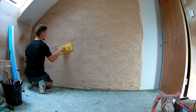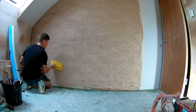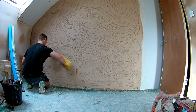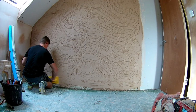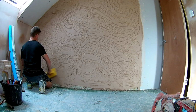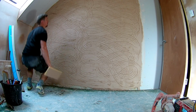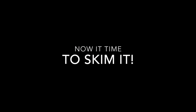As you can see, you'll see me working in an area, you'll see it in a minute. I keep coming back because there are a few high spots here. What I'm doing is I'm pulling them off and I'm getting rid of them. We don't want them there, we want them to be gone, so I'm working my float into them and then forcing them, pushing them out. So again, give it 30 to 40 minutes, give it a light spray, and then float it up. This means you'll get your wall really, really flat, ready for plastering. So now it's time to do the skimming.